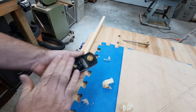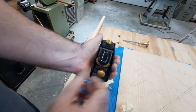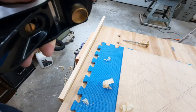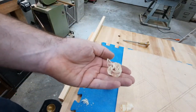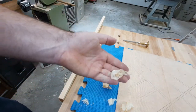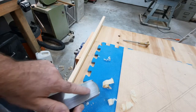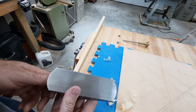To fix it, you tilt the blade — you can use the adjuster left and right, or what I like to do is take a small hammer and tap it until it's correct. Now you can see a full shaving on both sides, which means the blade is now the same distance out on both sides.